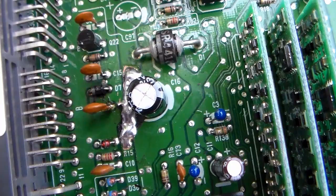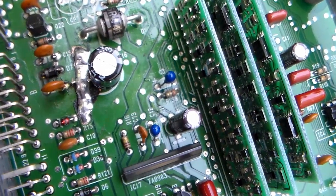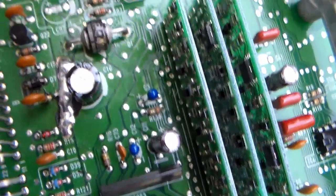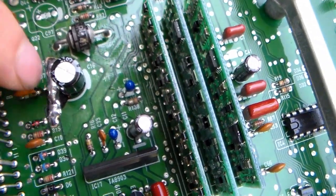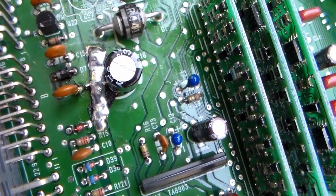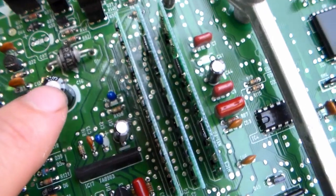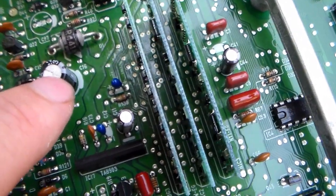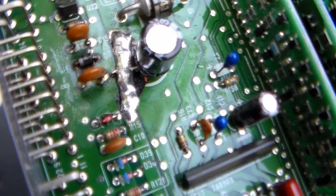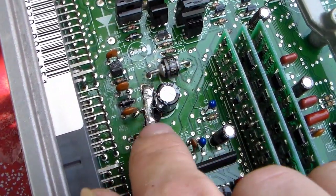This is the capacitor that blew. It burned a hole in the board halfway through the PCB. What I did was clean it really well and cut the bit of trace that was just foil with no board. I cut it back, then scratched the trace remaining on both sides with a knife until I got to copper. I took a piece of copper braid and laid it across, soldered the braid to both contact points, filled it with solder, and got the braid to be part of the board. One side of the capacitor I could put through the hole and solder on the other side of the board. The other side wasn't reliable, so I took the leg and soldered it to the braid to get that connection. The capacitor now has its connections back.